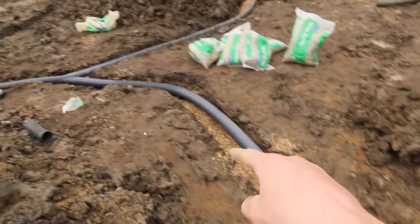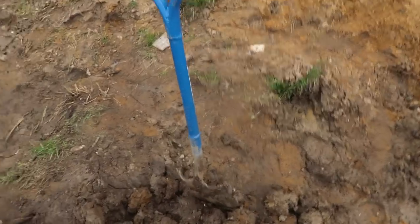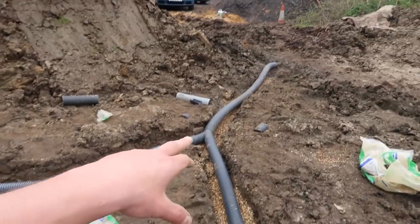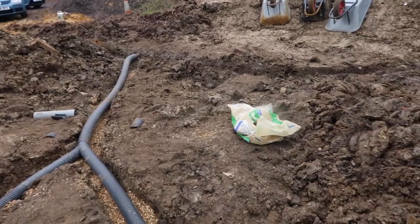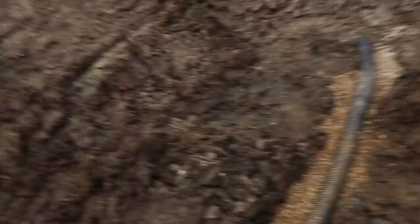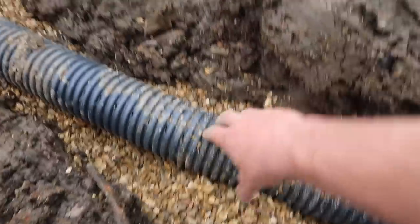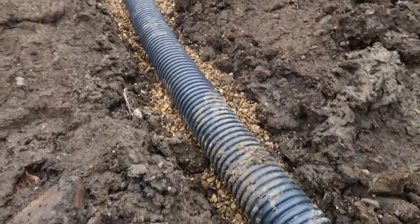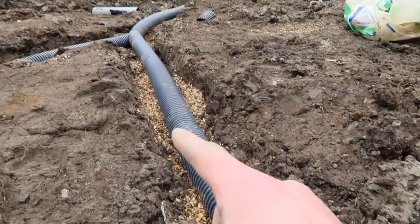I dug all the trenches with a shovel. Silverline sent me a trenching shovel, which is so, so helpful — it's like the perfect size. We went to the shop and put 500 kilograms of pea shingle in the car — it almost crashed on the way here because it was really heavy. I put a bit of pea shingle down in the trenches because you have to surround these perforated pipes with gravel, otherwise all the little holes that let water in would let dirt and sand in and clog the whole pipe. Gravel's perfect, so you need to put a bed of pea shingle down all the way through.